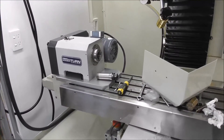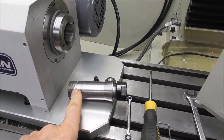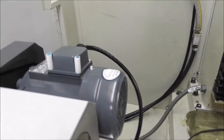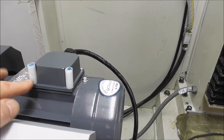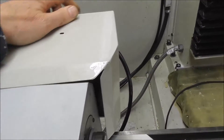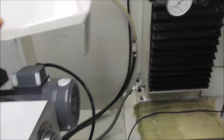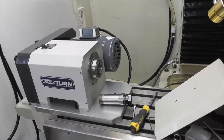I'm just getting my new Rapid Turn up and running now and just showing you a couple of little details. I didn't mention in my last video — I needed to cut a thread on the end of the ER20-5C adapter collet holder. I tend to use an arbor for everything. This is how I mount the guard on — I just put a couple of standoffs there, replacing a couple of the screws to get the height. And then I can screw that cover on there. Actually got it painted about the right color — I just got a bit tired of looking at the galvanized steel.